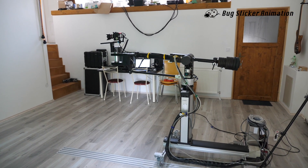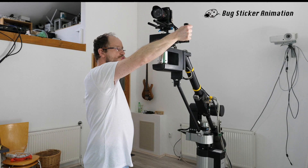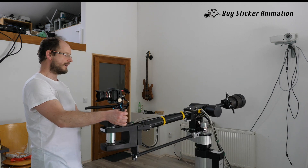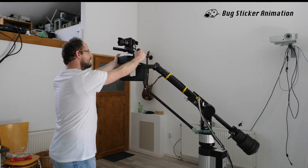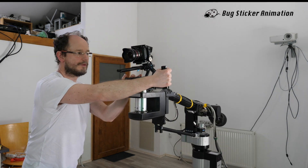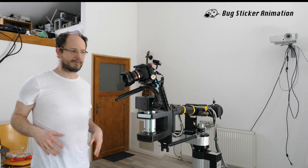As you can see, the movement area of the robot is quite big. I can lift my camera up about two meters, move it down about one meter. I have a slider which moves 0.8 meters, and I can also rotate the arm 240 degrees. So it's quite a large path I can reach with this robot. When I want to teach it, I start moving the head by hand, start recording the camera path, and then play it back. I usually have a camera monitor here which shows me what I'm actually recording.